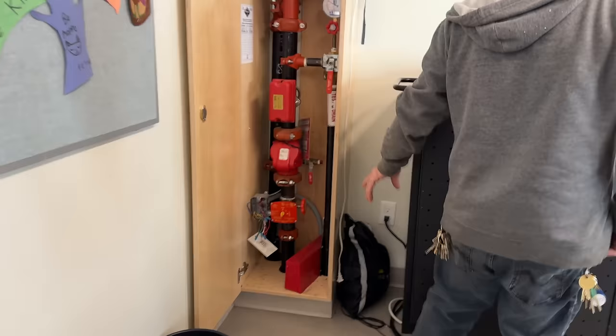Theoretically, even if we bumped the strobes all the way down to 30 candela, we would still be at, I believe, 3 point something amps, nearing 4. So the strobes, no matter what candela they were at, are going to be really pushing it for the power supply, and at 110 they're going to be well over double the capacity. Now, just considering the horn strobes with the horn current factored in, 43 of those at low volume, 110 candela, is over 6 amps alone, plus our 10 other strobe-only devices.